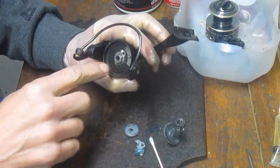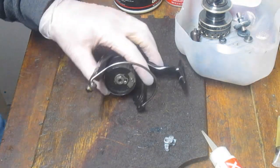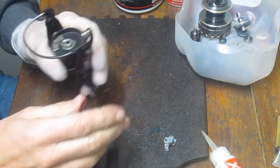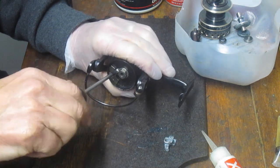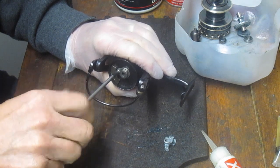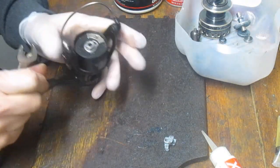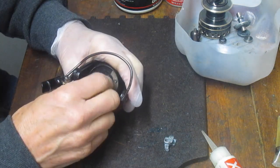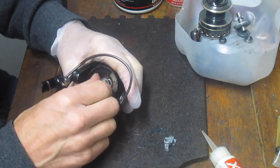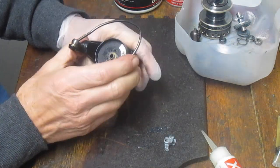We'll go up top now and take the case off. Let's take our rotor off. We're going to remove the set screw that holds a little holding clamp so that the nut does not swivel too much with rotation. Then we can back this off, remove the clamp and the nut, put those in our parts tray, and remove the rotor.